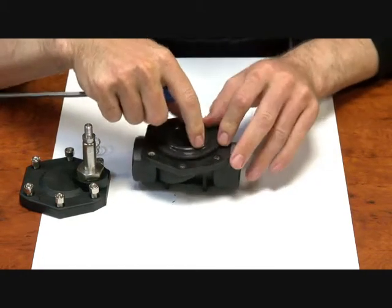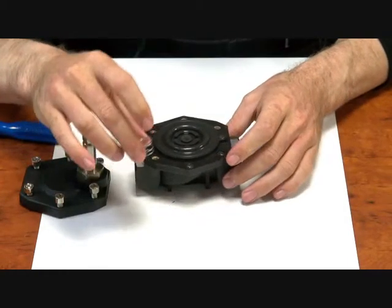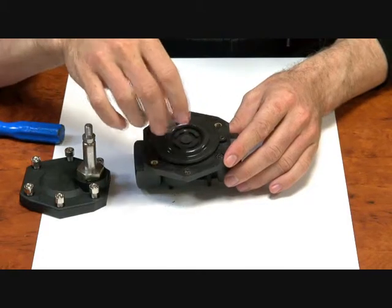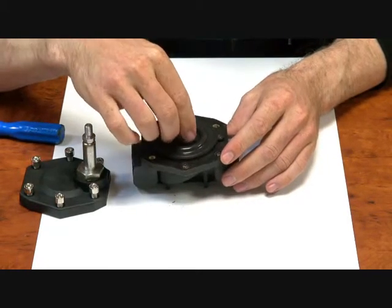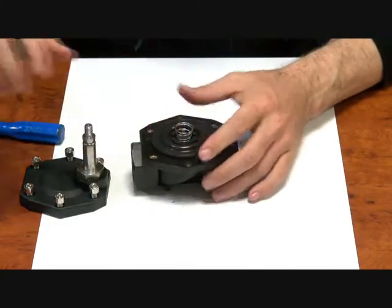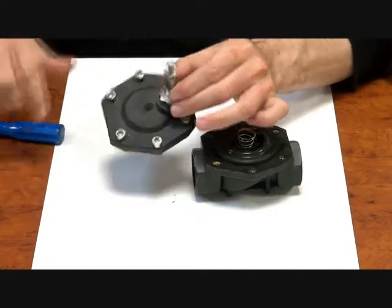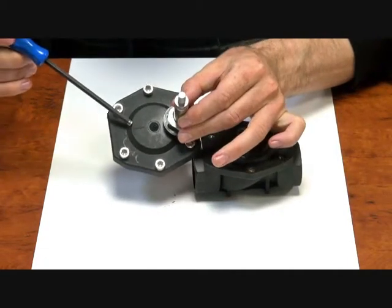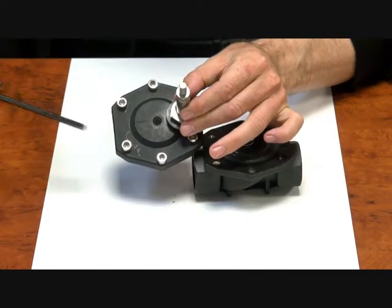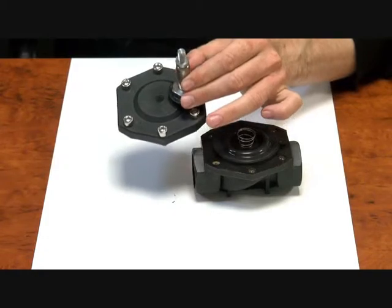Just put that one back in place. When you're putting the spring back during maintenance, it's important that these holes are clear. Also make sure the conical side of the spring goes down and sits on there. One thing to note on the valve is you can see on the roof of the valve here the direction of flow — this arrow indicates direction of flow. It must be installed with this direction of flow, otherwise it won't work properly.